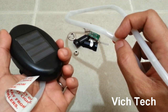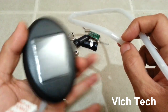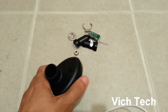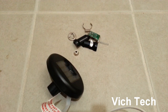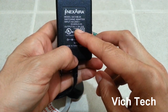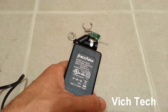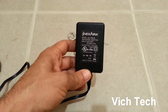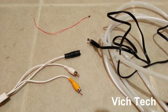However, I'm willing to sacrifice that auto-charging feature if I can just have constant power from a power supply. The challenge was finding a supply at 1.5 volts — the lowest they come is 3 volts. I have a few power supplies lying around, like one from an old router that's 5 volts at 3 amps. I could probably put 3 volts to the LEDs, but that would make them run brighter and decrease their lifespan, so I didn't want to do that.